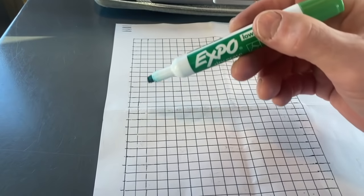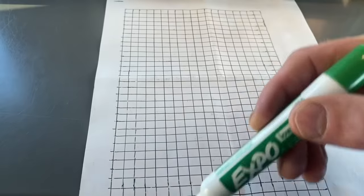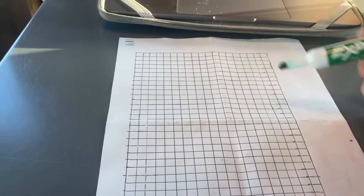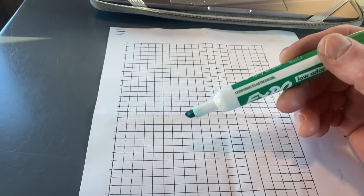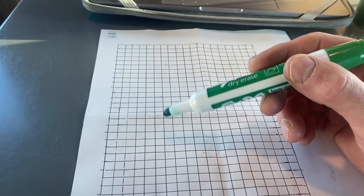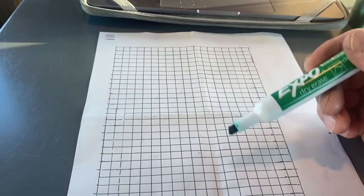I'll kind of draw you the first loop. It's easier, guys, to run your tubing the long way, because every time you run down here, you get to the end and you gotta turn and come back, and then turn and come back, and you keep looping it like this. To have fewer 90s, a lot of times it's easier to divide your building up the long way. So this being 40 and this being 30, I need 10 foot grids, which worked out real nice. If you look at the pictures of the floor that we did, your wire mesh lands in 5 by 10 sections. So we had a 10 foot seam here and a seam right here, so you had 10, 20, 30. It was easy to divide this into three different pieces.